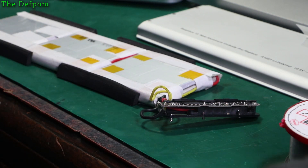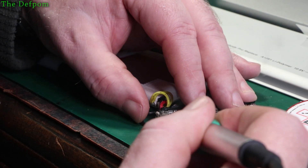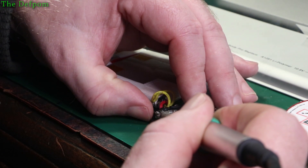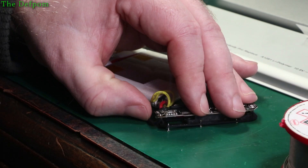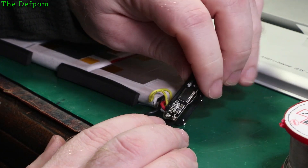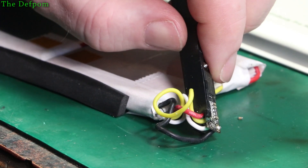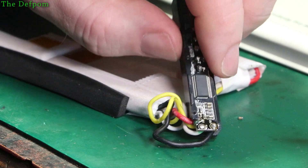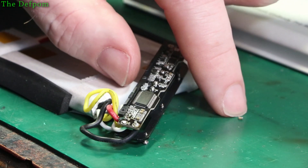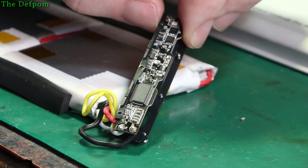The camera's covering the flux — lovely jubbly as Del Boy would say. Let's try again — melt it and push the wire back up. Okay, that's looking much better. That's now soldered much more nicely. There's a bit of lead-free on there, but then — a capacitor has fallen off! See that?